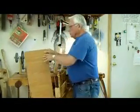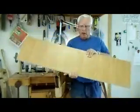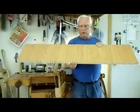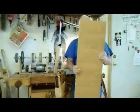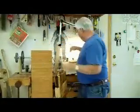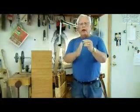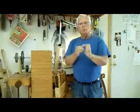I went to Menards to buy this formica. It's shelving material. They had some seconds on a pile. So a board like this here that makes three pieces, that's $1.99. So they're quite cheap to make. The wood dowels, you just cut the dowels to length and just take a long dowel, 3/8 wood dowel, and you just take it on your saw and just saw it off short little pieces.